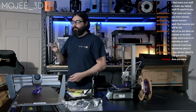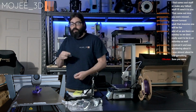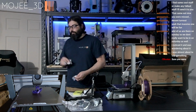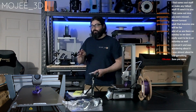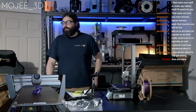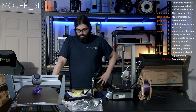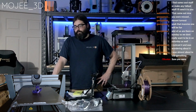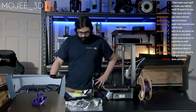my carbon fiber machine. So PETG carbon fiber, PLA carbon fiber, ABS, you know, and that all prints great with a 0.6 or 0.8. Sometimes carbon fiber filament can be weird with a 0.4, depending on the brand or the make, they can clog. But that K1's fast, and then you put a 0.8 in it, and they print pretty good. So we're done.